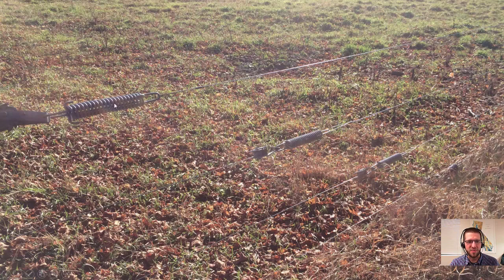Remember that the tension indicator spring does not add any bounce to the wires. It's not a springy shock absorber. Once it's fully indicated at 250 pounds, it's fully bottomed out and doesn't bounce anymore.